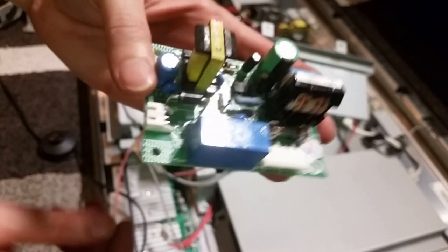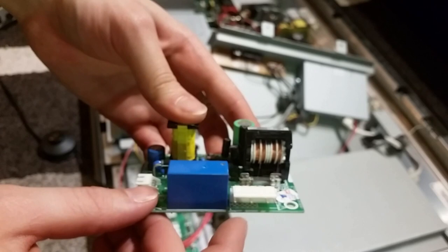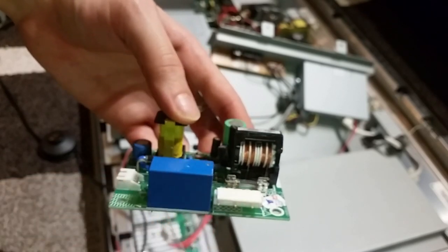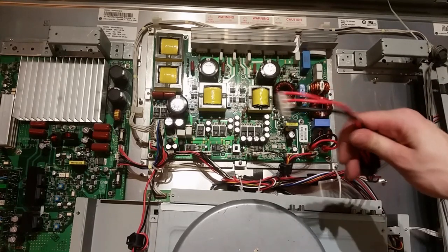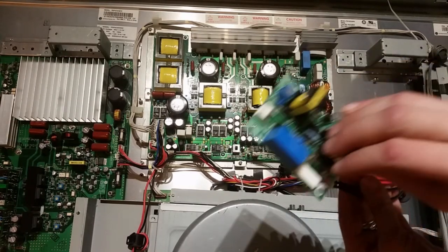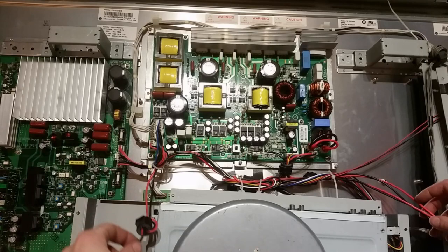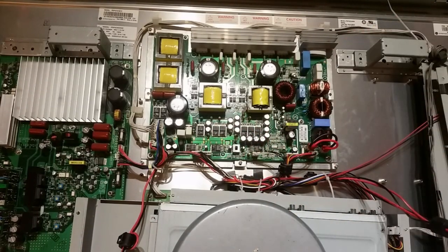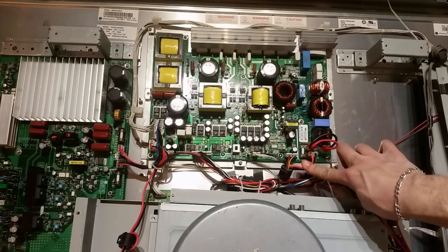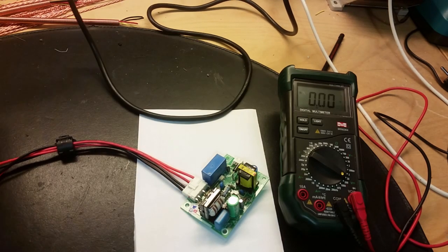We got this connection here which is connected to the main board, and it turns this relay on and off so we can get power to the main power supply. If you look at the main power supply, we got this cable that was connected to this small power supply. We got this wire here that comes from the main power terminal, goes into this, to the relay, and goes back to the power supply here. So now I've got this little power supply — I'm going to measure some voltages and see if it's faulty.